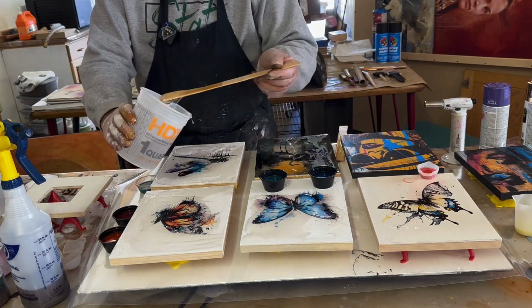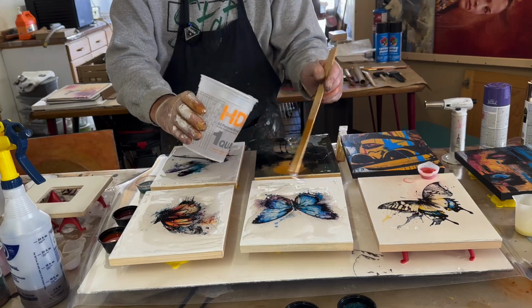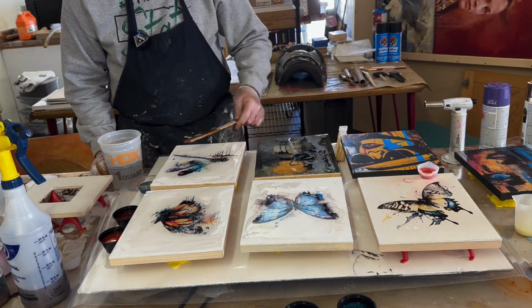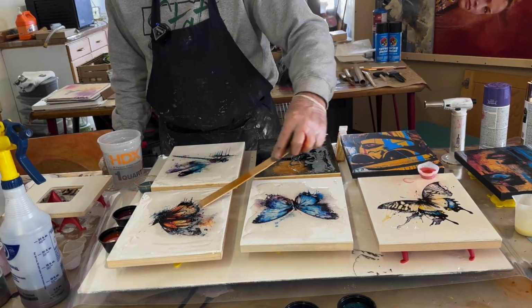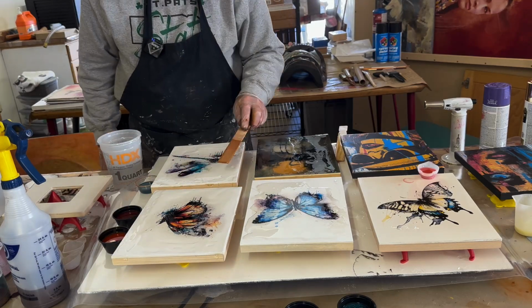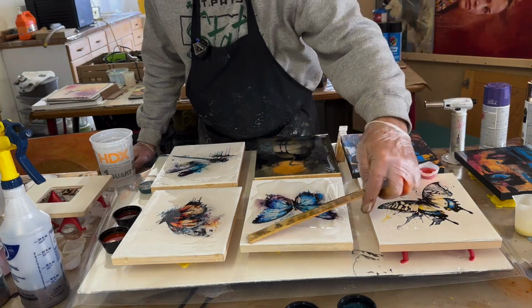I mean, this is a pretty small pour. It's only 27 ounces, so really tiny pour. So it wasn't quite as big a deal. But if you're doing anything larger, and certainly a countertop, you would want to use a square notch trowel. It's just much faster, and you get a much cleaner gauge, really, of resin. That's what the 1/8 inch by 1/8 inch is.